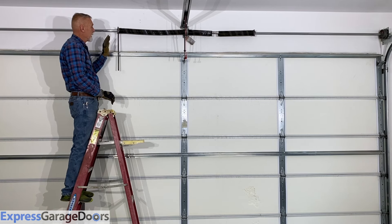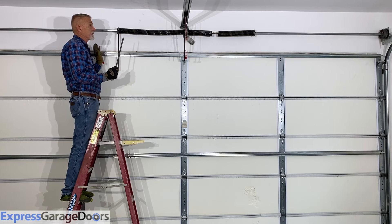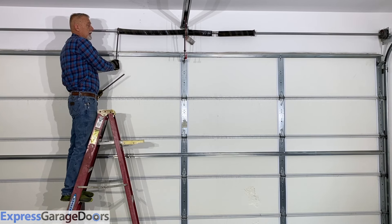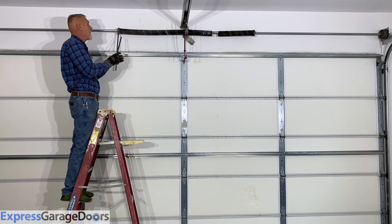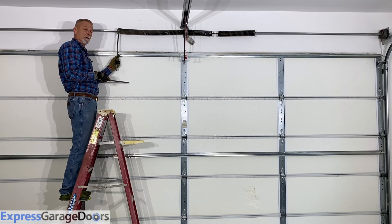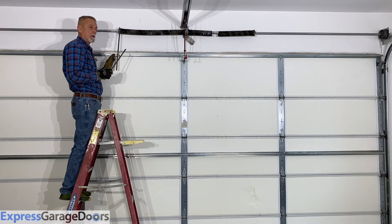All the force of the spring is centered right here. The way you unwind the spring on a standard lift door is to take the pressure off this bar, put it on the other one, and let it unwind — one quarter turn every time. On an eight-foot door, each rotation requires four turns of the cone: a seven-foot door takes 28 turns, and an eight-foot door requires 32 turns. Unwind until there's no more tension on the spring.